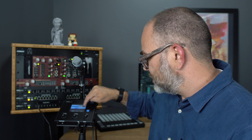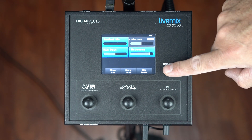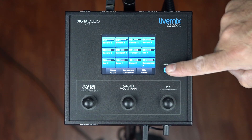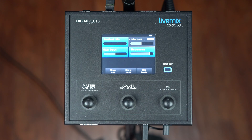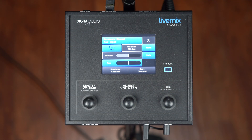So now I'm going to go ahead and exit this. You'll see I've got the intercom off, but when I press it to turn it on — this is in latch mode — you'll see a white light in the status bar and you're going to see the active flag show up on that cell. That allows you to know whether the intercom is active, and you'll be able to see that white flag no matter what page you're on, so that makes it pretty handy. In case you hear some room noise and wonder where it's from, you can look back and say, oh okay, the intercom is on — I see the light on. When you go to the auxiliary input while using the LM Mic Pre, the share aux will be disabled because it's actually using the auxiliary and sharing it on the intercom channel, so it's not available to be used on the aux channel.